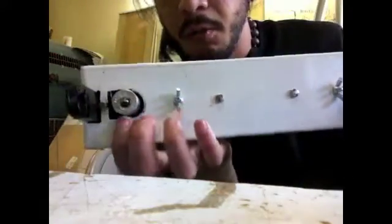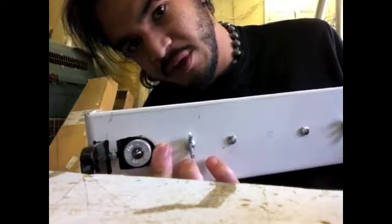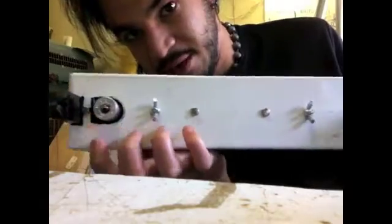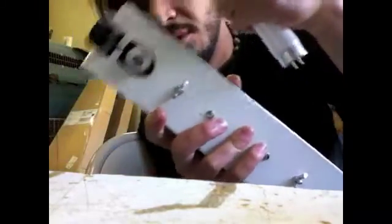So the starter socket hole — I originally drilled a hole, but it was slightly misaligned from the lamp holder, so the starter didn't go in, so I had to cut it out with the jeweler's coping saw and make it arch-shaped. And the end plates are part of the ballast cover. It's all part of the same piece of metal, which makes things a little easier.